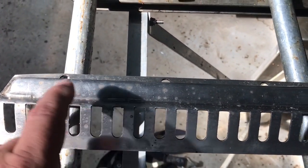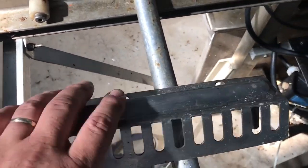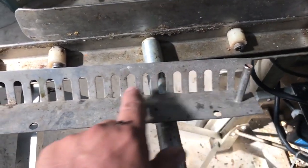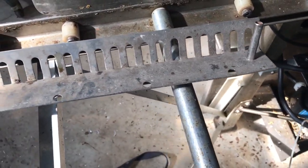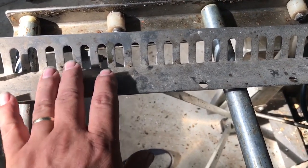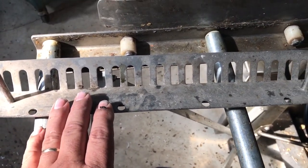There's a tube running down the backside fed with two water inlets, so hot water is circulated to keep this thing warm enough to keep the wax from sticking to it. The heat isn't enough to cut the wax on its own — it's more of a maintenance thing, and with these serrations, if someone forgets to turn the heat on, it's not a crisis.